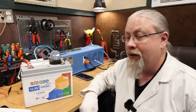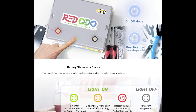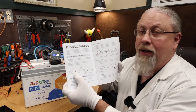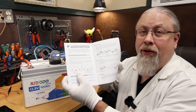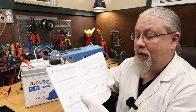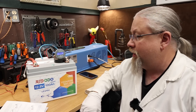The button is color-coded — it turns green or red and the manual tells you what each color means. For example, this battery has low temperature charging protection. If the light turns red while you're using it and it's below 32 degrees, it no longer allows you to charge. Then it turns green again once the temperature raises. So let's do the discharge test first and see how much power we can pull.